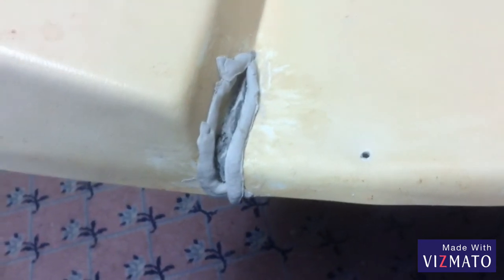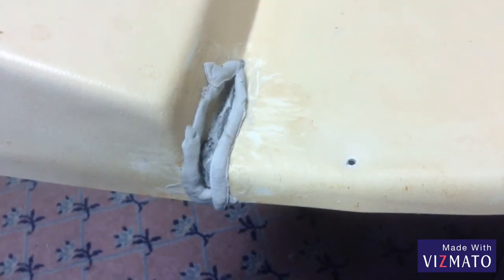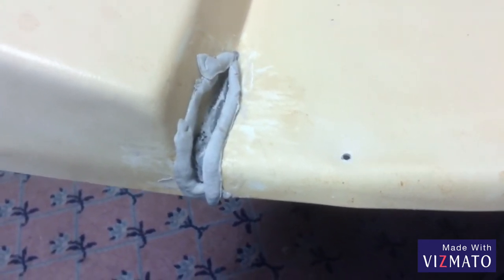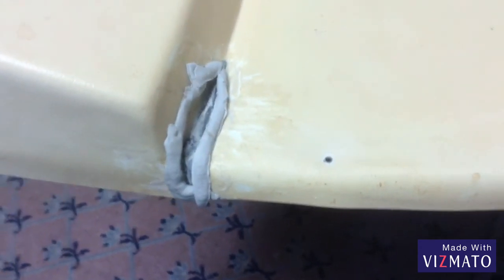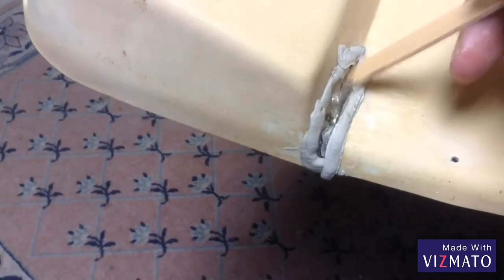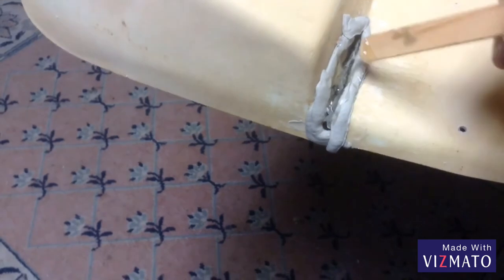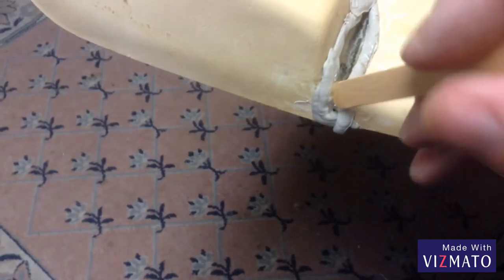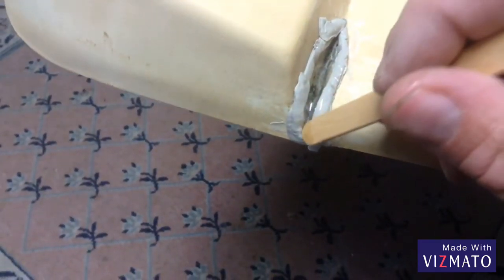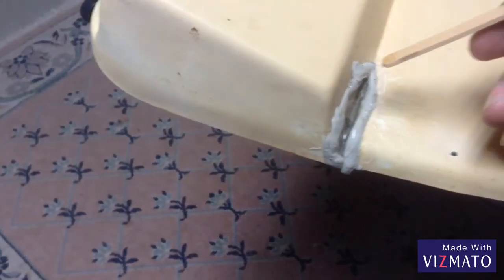This time I've used cord weather stripping clay to fill exactly where I want the epoxy to be, so last time I did it after the fact. I'm trying to be proactive and make sure it stays right where I want it. I was giving it a squirt — I didn't pre-mix it, so I'm going to mix it in there now and try to get it formed where I want it. Obviously I'm going to have to wait another 24 hours before I can try sanding this. It's been still kind of tacky — just kind of a rubbery consistency after the fact. So it doesn't sand as well as I thought it was going to.